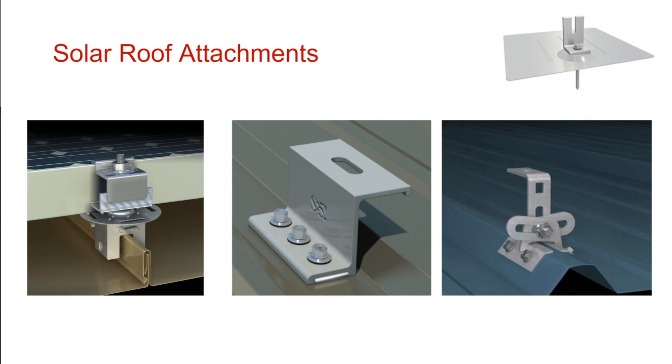What leaks on a rooftop after an install is not the work that you've done. It's the stuff that's already up on a roof, and you've been walking around on a roof with these heavy solar panels, and you step in the wrong spot on a roof, you slide your foot, step too close to an existing plumbing vent or something like that. You're damaging the waterproofing that's already up there. So you've got to be careful when you're on the roof to step carefully, but it's not really the solar array that causes a leak if a leak does occur. And it's kind of funny, it's very rare to have a leaky roof in solar. It's much more likely that there's going to be some other kind of project issue.